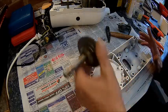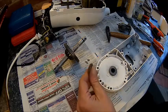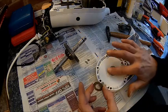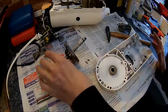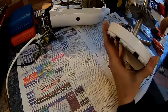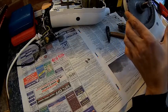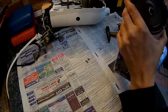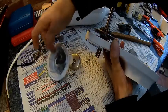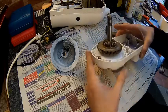We've got a bunch of washers here — make sure it's clean, no grit or whatever. The big gear has to go in first, otherwise you're not going to be able to put it in later. Because there is an O-ring here which basically stops the grease from coming out from the cup. This sits underneath and that O-ring seals here, so the grease of the whole thing doesn't come out.